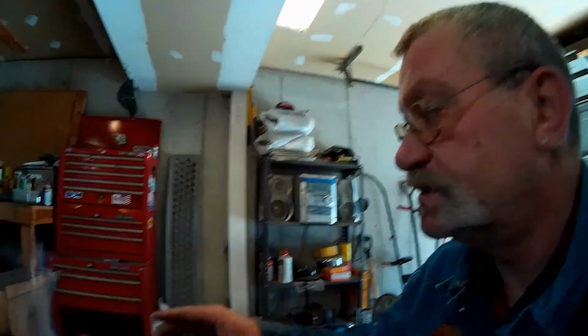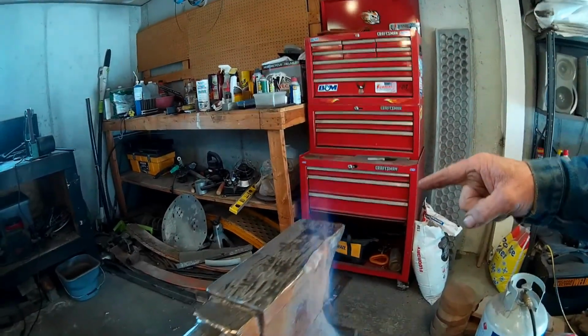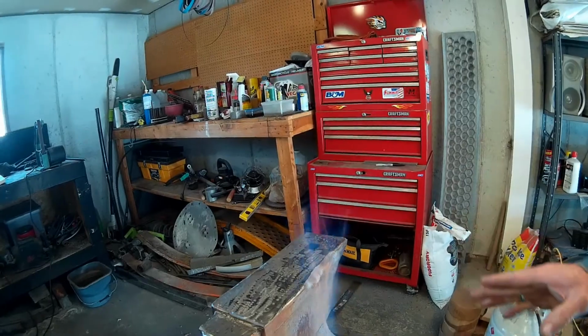Like I said earlier, maybe the sides will bevel down a little bit again, because after all, you can see where I had to grind away part of that hardened surface because it was so chipped and cracked. It's just the way it is. So part of the surface of these edges is going to be weld instead of hardened faceplate. But by peening the welds as I go and having my anvil heated up, when I start to pound on this anvil and use it to make blades and bottle openers and tongs and whatever,